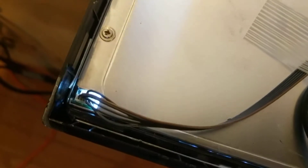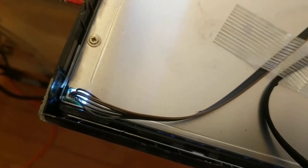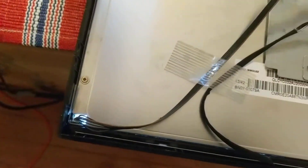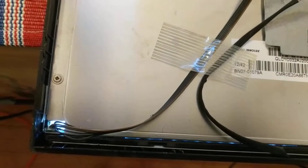Here's the back of the monitor plugged in for the preliminary test. Probably the first good sign — you can see the backlight is powering the monitor, and that's definitely a positive sign. You will not see that when the capacitors have gone south.